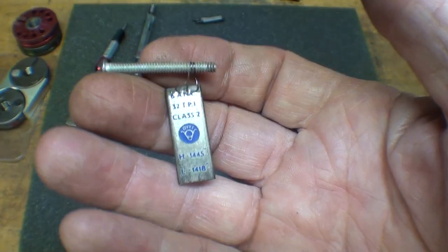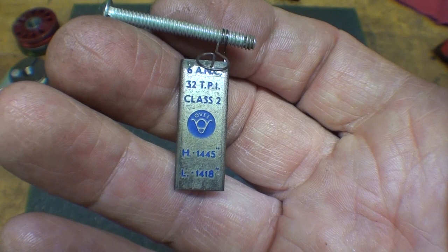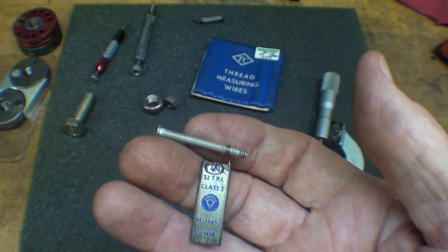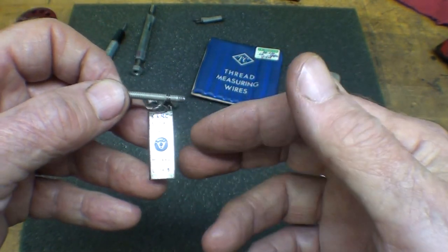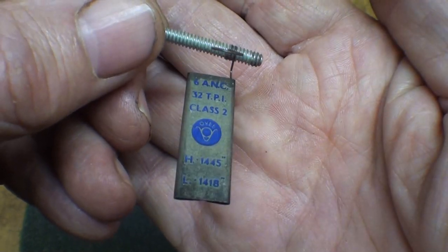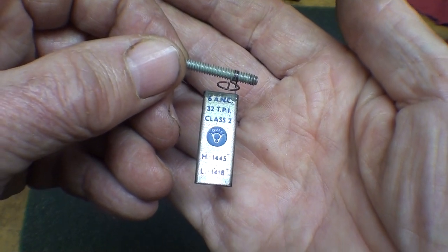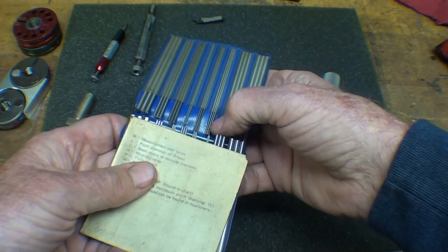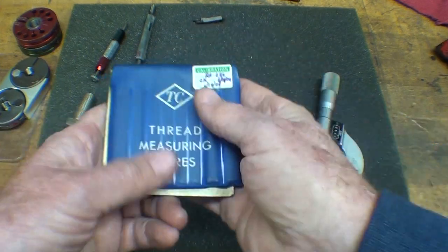So let me talk about the OV gauge now. This is an OV gauge — that's a brand name — and I had a complete set of these at the high school, but they are hard to hang on to; they're easily lost in a shop in the chips or just by carelessness from the kids. So I had a chain on each one. This came in a recent auction and I only have one, in the 6-32 size, a relatively small size to demonstrate on. In effect, this is the three-wire system, only conveniently held.